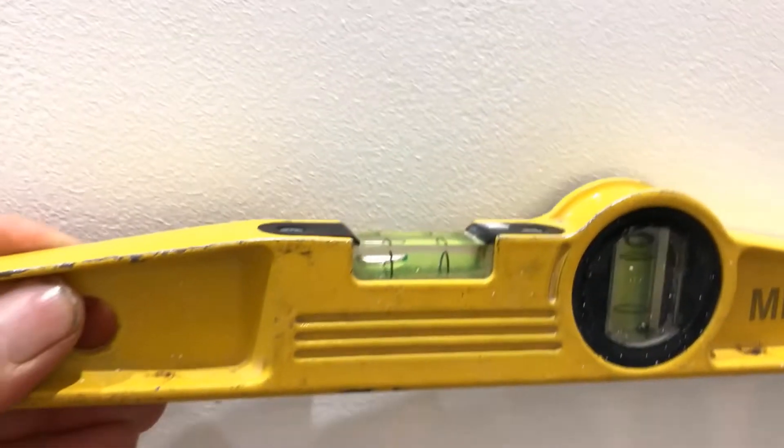Back to the wall. We need the bottom of the TV to start from this mark, about 20 centimeters from the radiator. So from this point I have to measure 11 inches up - and that's where I draw a line using a water level. You can see the tiny line there - that's what I used to make it level.